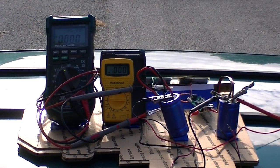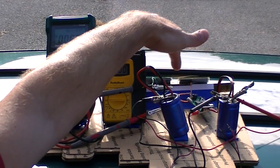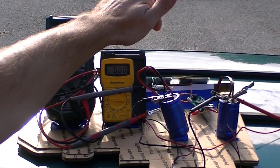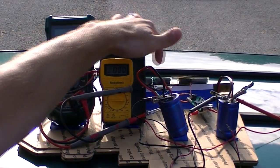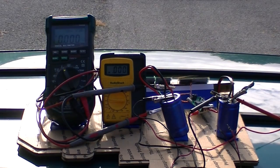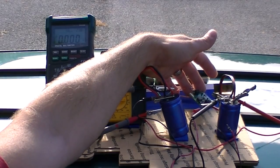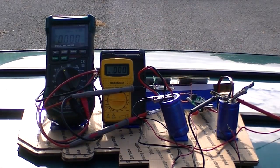Here's the test rig. It's not exactly the most beautiful looking thing here, but basically I got two setups with solar cells. This one is basically just the solar cell, the supercapacitor, and it's running through a blocking diode — a little tiny black thing right here — which is what I was using in SolarJar version 2.0. Now, this one has a solar cell going through the new MPPT charging chip to charge up the supercapacitor.